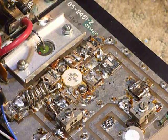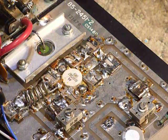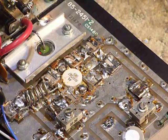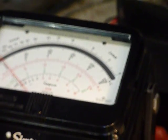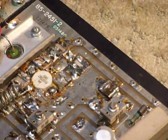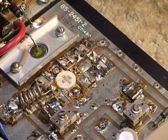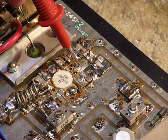I brought it home and I wanted to show you what it took to get it going. First, I'll show you how to check those transistors in these units. You set your ohm meter on R times one. I've got here a Simpson 260 meter, and I wanted to show you that this connection right here is the base of that transistor.